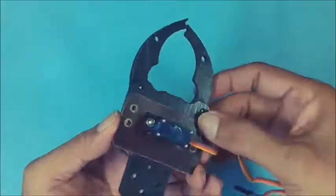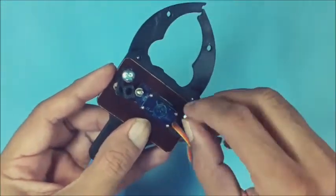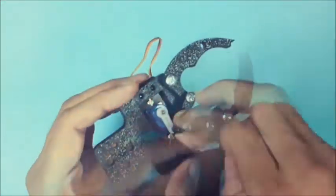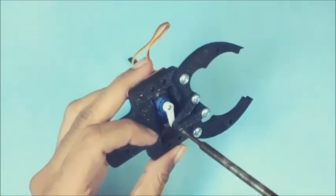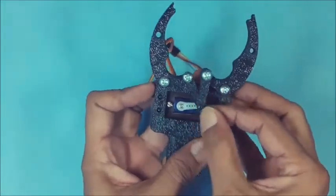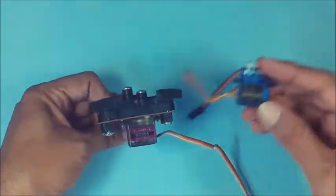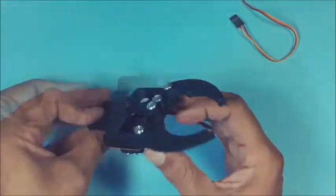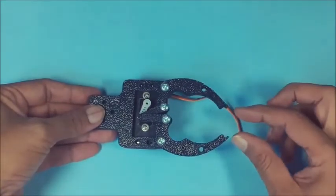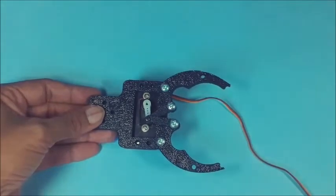Place the plate as shown, then fasten the plate to the base frame using 4 screws along with spacers if required. Connect the free end of the horn to the 2 free ends of the links using a thin long screw. Make necessary adjustments if required. You may use either MG90S or SG90S small servo. Test the assembly as earlier, and after a trial run, adjust the gap between the jaws by changing the position of the horn on the servo shaft, then test again.